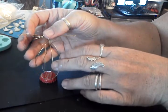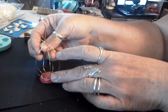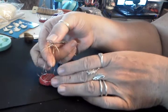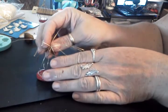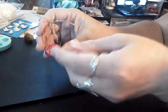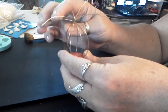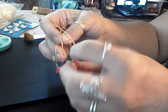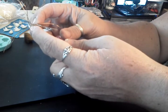Then you're going to take your wire — this one is crisscrossed across to its mate — and bend it over the top of everybody else, tuck it back in, put my thumb on the top, and kind of push that wire back onto itself, back to its original starting point. And that kind of locks it. Then I bring it all the way through and bring it back up top. So we're going to take this wire, cross it across the pile, bring it back to itself, and bring it back up into the air. It just crisscrosses or locks itself across the pile — you're going to do that with every one of them.